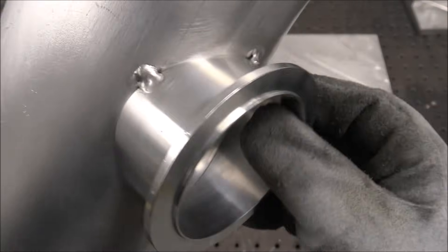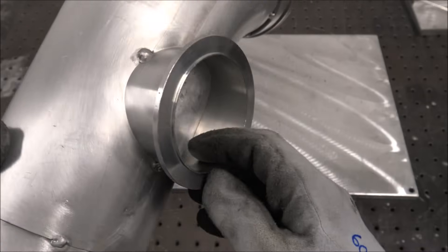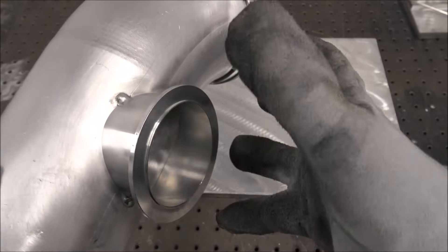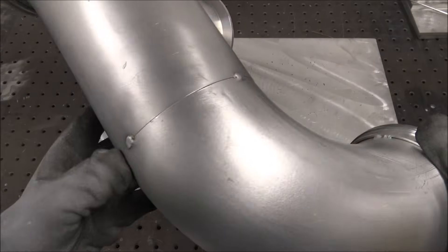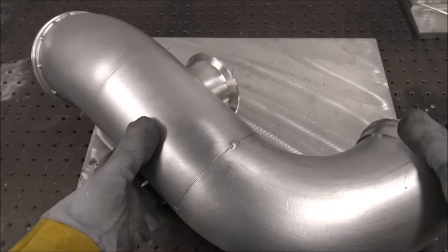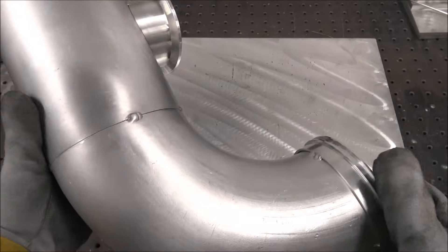Here's where the blow-off valve goes, and this is good — he hasn't drilled this hole out yet. That will minimize distortion when you're welding it. If there's a big gap in there it can make it flex, contract more, and distort the surface. One potential problem is I don't know how well these joints have been cleaned, and I can't break them apart because this is exactly how he needs it to fit — very little margin for error. So we'll see how it goes.